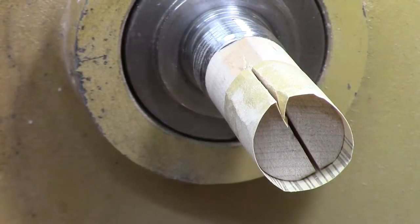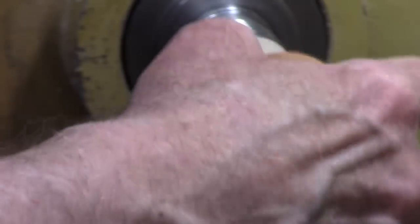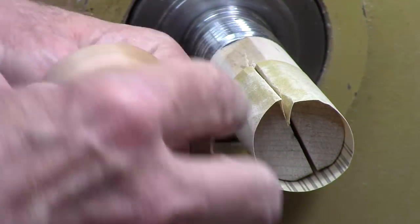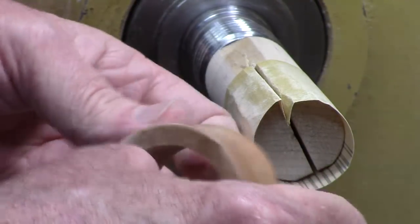For a spindle sander I simply did one of my wooden morse tapers, cut a slot down the middle, rolled a piece of paper around it and tucked it in on both sides. Just slide this on, do it at a slow speed, and you can clean up the inside really easily. Then buff it and put on your finish of choice. I like antique oil, so that's probably what I'll put on all of these.